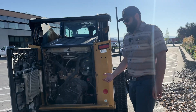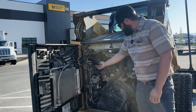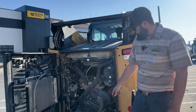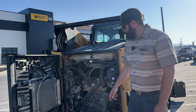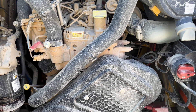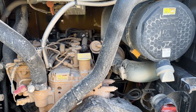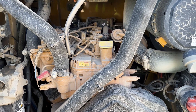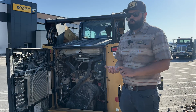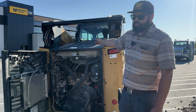The biggest change was moving the fuel tank from underneath the engine — it's now on the sides. We have two side packs with a common tube that runs between the tanks underneath the engine. From a maintenance standpoint, it's a lot easier to access that fuel tank; it's not underneath the engine where it's compacting with dirt. That lowered the engine down several inches, which lowered our center of gravity for better stability. It also gave us a bigger back window for better visibility.